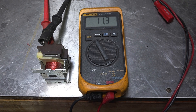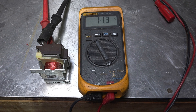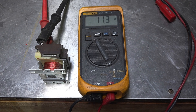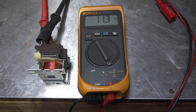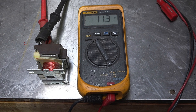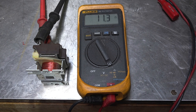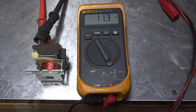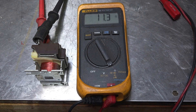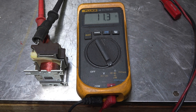The lower voltages — and these are all AC — use larger wire. The higher the voltage of the coil, the smaller the wire, and of course the longer the length. That increases resistance — not talking about impedance here, just resistance. So a higher voltage coil will always have smaller diameter wire and longer wire.